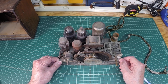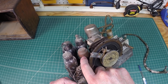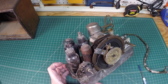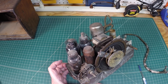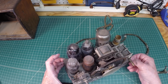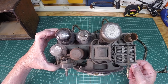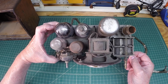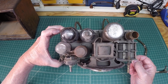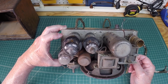The speaker looks like it's probably a five-inch speaker — yep, five inches — which was pretty common for that period of time. Here's that other tube I had mentioned: that is a ballast. I recognize that number; I think I've had a radio before where I did a repair that had that same ballast tube in it. It looks like a 50A2.